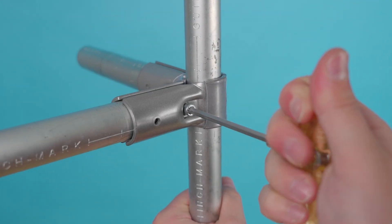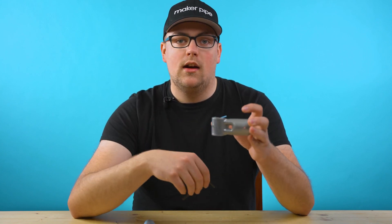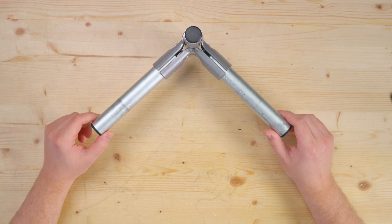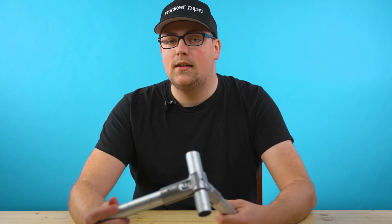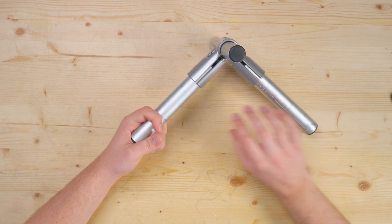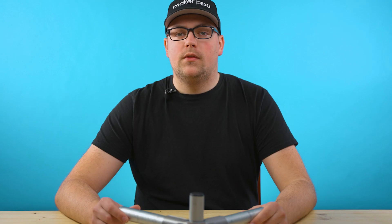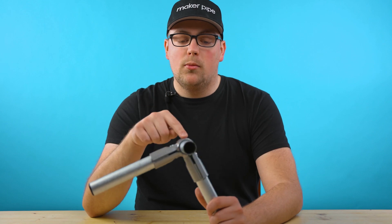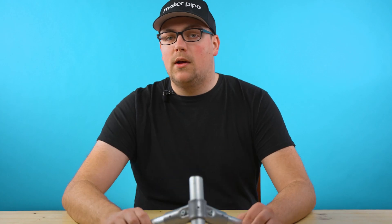This makes it easier if you're working on a desk with a tabletop sitting on top — it's much easier to loosen or tighten the bolts on the outside than working on the inside. Once fully assembled, it connects three pieces of one-inch EMT conduit together. There is one center pipe that runs continuously through the connector, and then on the outer ends two terminating pipes clamp in at a perpendicular 90-degree angle. The 90-degree connector adds two and a half inches to the ends of the connected pipes, and the through pipe sits an inch and a half inside the connector. You'll want to keep those measurements in mind when figuring out your project dimensions and conduit lengths.